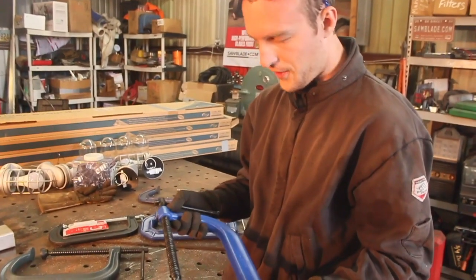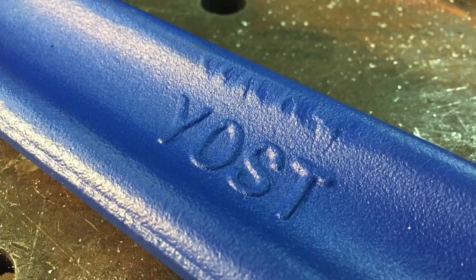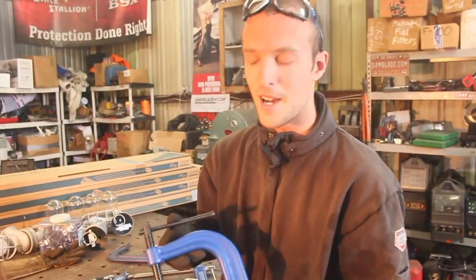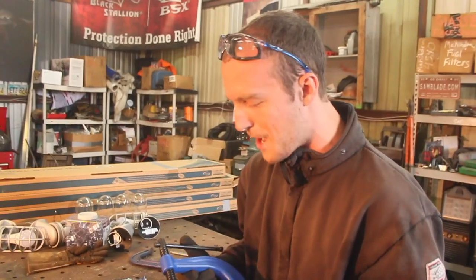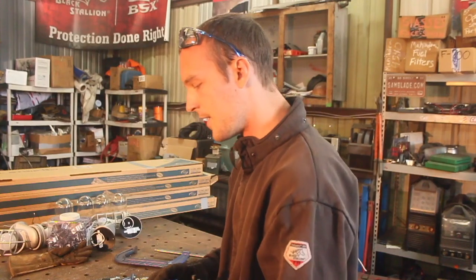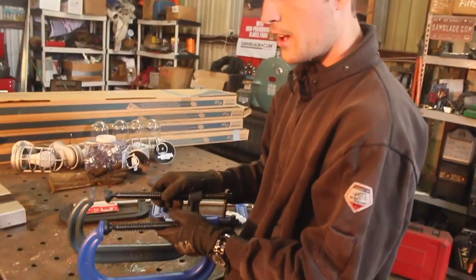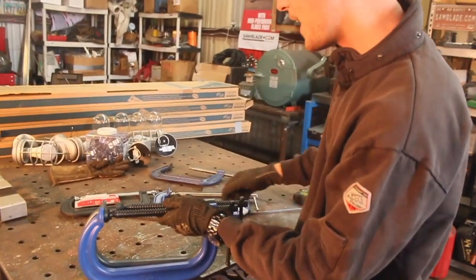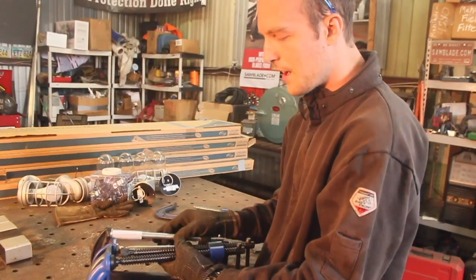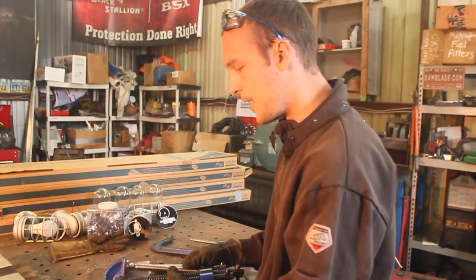These things are actually incredibly well-made, except for a little rough spot on the casting here and there. I think when the video's done, I'm going to go buy like five or six of these for the shop. The reason I like them is they have a very heavy screw — identical to the one on the Wilton C-clamp that costs a lot more — and it's much larger with much more durable, fatter threading than either the Irwin or the Bessie.